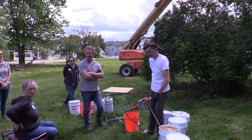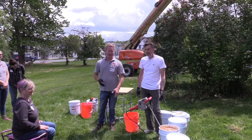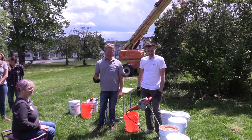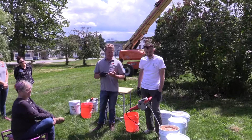I add water back incrementally to avoid over-watering, but if you do put too much water in it's not a big deal — the water will work its way to the surface but it could take a couple of weeks. If time is on your side and it's too wet, leave the lid off and it'll begin to dry. The beautiful thing about lime putty is you can keep on adding water to it.